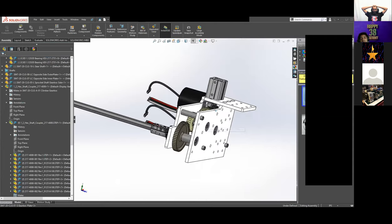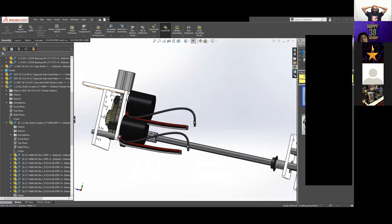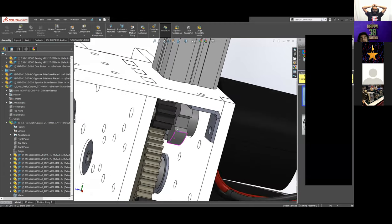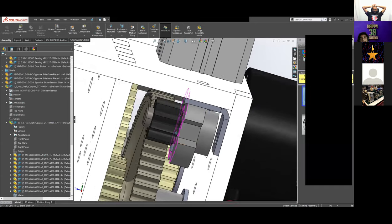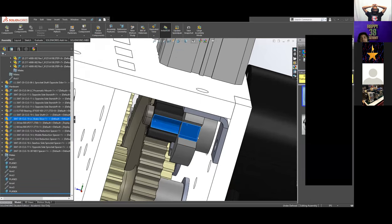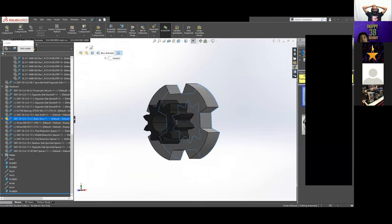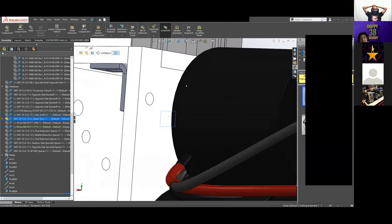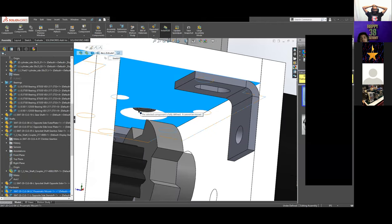Where this gets interesting is, because we were holding 300 pounds, we didn't want to leave the weight on the motor, just the Neo brake, on like brake mode. So we designed a pneumatic brake. Basically, it's similar to how we did the shooter pinions. This is a Delrin part that's just laser cut and then pressed onto the pinion. And then it has these spokes for this pneumatic cylinder to press into, which will brake all of it.